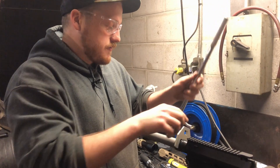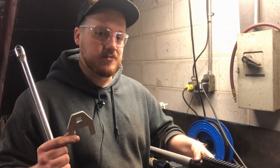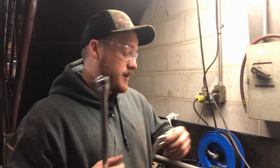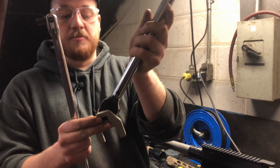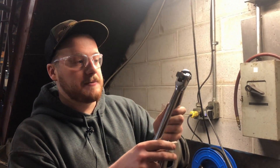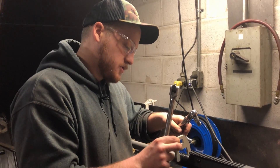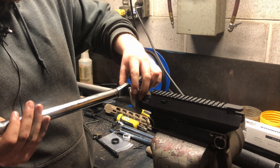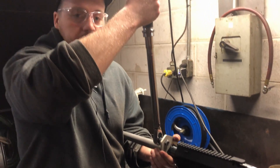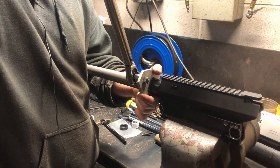I'm not really a big fan of the crow's foot system — I prefer the Geissele system where it's just a hole in the barrel nut. This crow's foot almost slipped on me before. I swapped to a smaller torque wrench with a half-inch drive adapter because the larger one was hitting the barrel nut. This is the third and final tightening pass. Always torque from the top pulling down, and I like to hold it in place so it doesn't slip. I heard the click — it's torqued to 35 foot-pounds and the barrel is mounted.